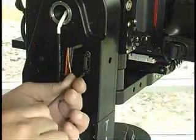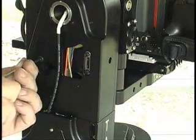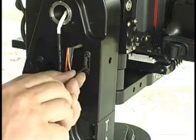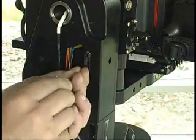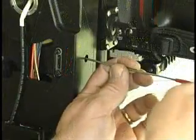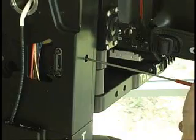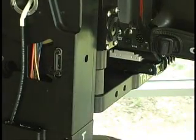Please be careful not to over-tighten the worm shaft, or it can bind and cause servo tuning problems later. After you have obtained the perfect backlash setting, retighten the four worm housing 5/32" Allen screws evenly — approximately four to five foot-pounds will suffice. Also check the jacking screws to make sure they are making contact with the adjusting wedge; this will ensure the wedge will not slip under extreme loads. After all screws are tightened, once again check your backlash manually by driving the worm shaft and pushing the tilt plate forward and aft.